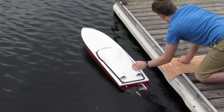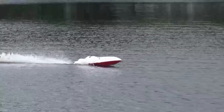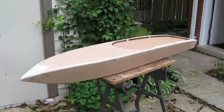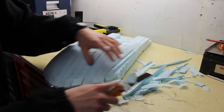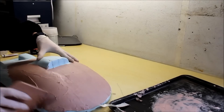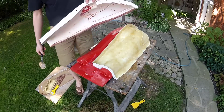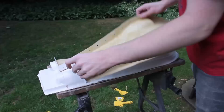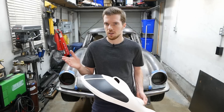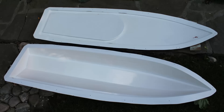Yeah, that was terrible. This 54-inch gas-powered fiberglass boat started the channel 12 years ago. And although both our videos and techniques have come a long way since then, its method of construction is still relevant. I used two basic materials to create the shape: wood and foam insulation. These forms, known as plugs in the world of composites, took weeks to get right, and in the end still weren't perfect. However, they served their purpose and allowed me to make some molds. Just like a bundt cake, these are the negative of our shape, and once treated with a release agent, more fiberglass was laid inside them to create our finished parts.